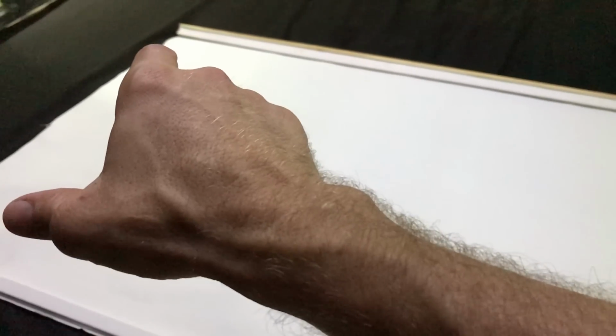Now what you want to do is make sure you cut this bigger. Width-wise, it's not going to change. But do cut it a lot longer than you think you need. And then build the whole thing out where you think, because you're going to need a little extra room. Also remember, if you're watching a VGA screen, it's going to be big and square. But if you're watching a movie in the letterbox, it's going to be long and not tall. So you need to leave enough screen where you can watch all those modes.